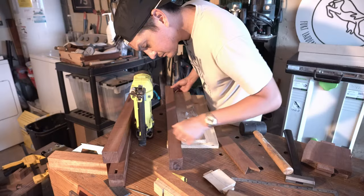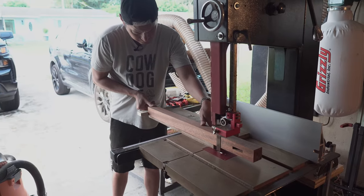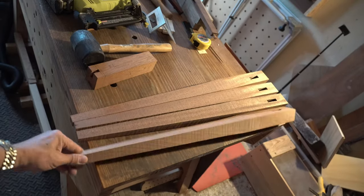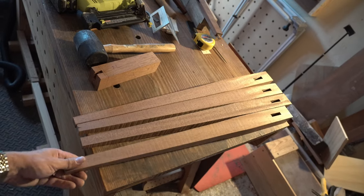In an effort to make some more interesting lines, I just whipped up a really quick and dirty taper jig with some plywood and brad nails. I considered doing an octagonal leg, which I sort of still wish I did, but it would have taken some extra jig work and I was really pressed for time. Ultimately, just a four-sided taper gave enough visual appeal and lightened the whole look of the table base.